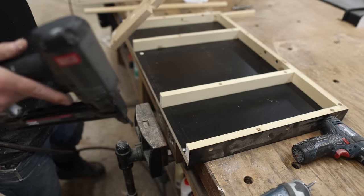The doghouse is coming along and I love this transition, however I'm not a hundred percent sure how to finish this corner. I don't want to put anything over it, and these obviously don't line up. What I'm thinking is flush cutting one of these and then doing a round-over on this so they kind of blend together like a wavy finger joint, so we'll try that.